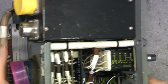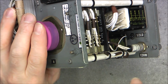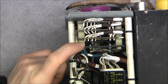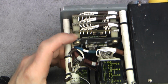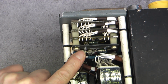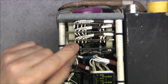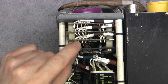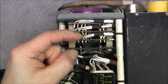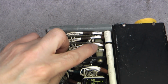And you can see also I did not mention two other things at the back. For each device you have the device number which is written, and you have this little stack of circuit boards with, on the first one, just diode, clearly written here. This one is actually an aluminum plate, it seems, with two Teflon insulated standoffs. And the three other ones are actually circuit boards with each time, it seems, a glass coated power diode and power resistor, excuse me, and 3 diodes. Also, you have on each wire the wire number stamped onto little bits of each link. A lot of little numbers written here also.